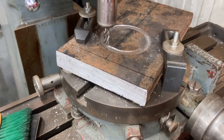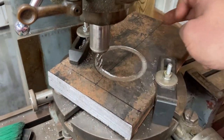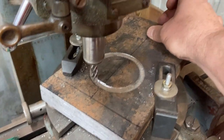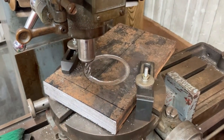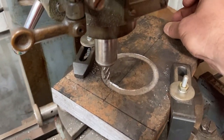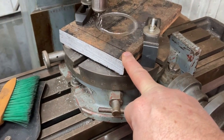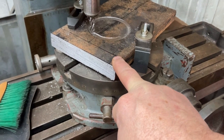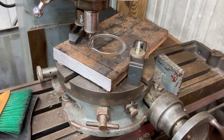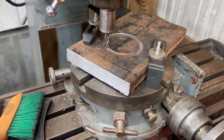We'll take this up to Ray. I need to cut a 3-inch hole for the hook and a 2-inch hole for the pin. The distance is adequate — it's what the original Yale setup used. I'm going to go a little extra on top to have even more thickness than what they did. Their plate I believe is only three-quarter to seven-eighths inch — not even an inch — so this one-inch plate should be overkill and plenty fine. We'll just have to get it milled out when Ray has time and then we'll hang that crane.